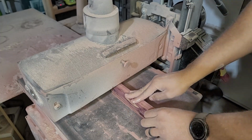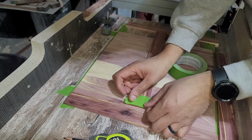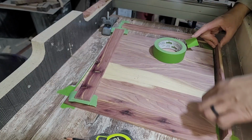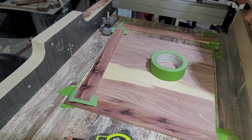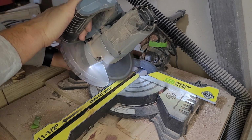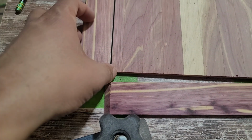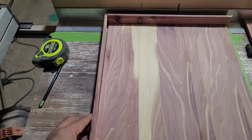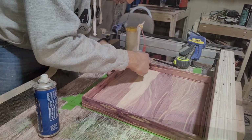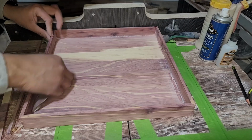Here's those side strips for our base that obviously I trimmed up on the table saw and then took through the drum sander to make it a little smoother. The last thing to do on these was to cut our mitered edges. I was proud of this because this is me advancing my skill set a little bit and putting some 45-degree angles on here. I inched in just a little bit at a time so that I didn't go over, and the tape helps me avoid chip out, as you can see here. I did end up going just a hair over, and you'll see how I correct that in just a little bit. I also went a little overkill on the CA glue here, so I'm hoping that mistake can be to your enjoyment. Here's an ASMR moment for you.